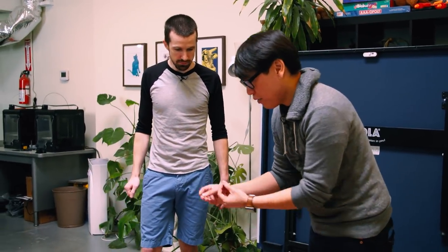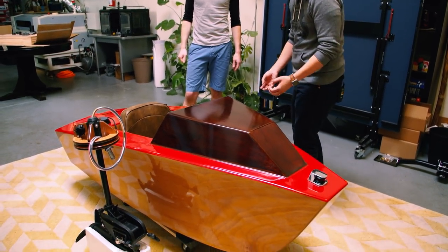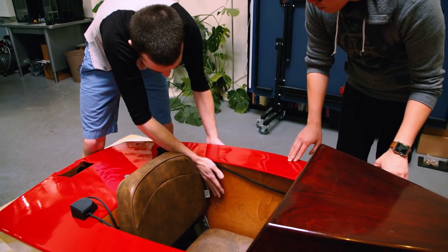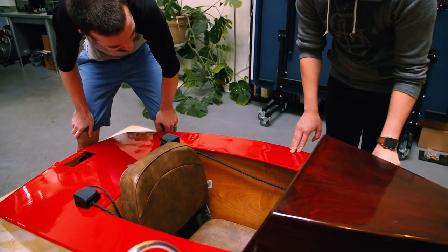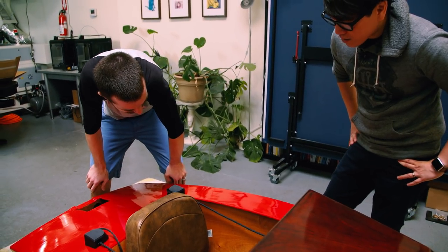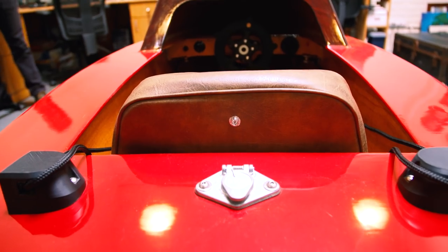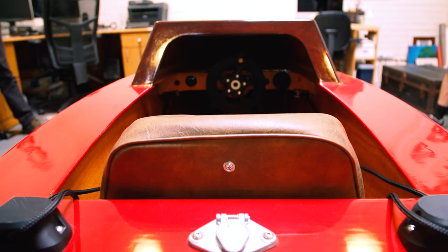Then the assembly: you have your zip ties, pocket it together, and to get it waterproof and buoyant, there's a bulkhead space. We've got about six inches of what would normally be empty space, filled with closed-cell foam. That provides emergency buoyancy when the thing gets flooded — so it's basically unsinkable. It can still capsize, but it's not going to end up at the bottom of the ocean. The bulkheads provide about 210 pounds of buoyancy.